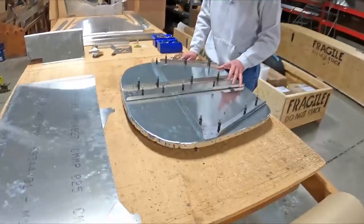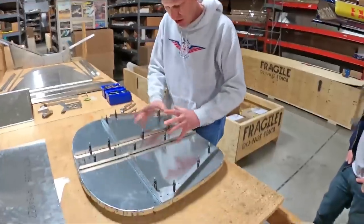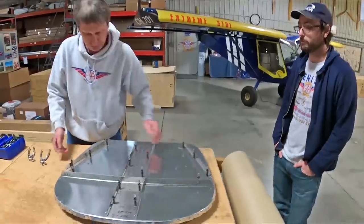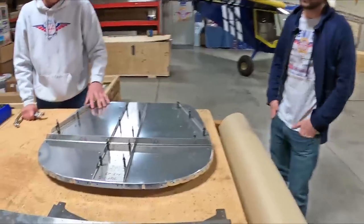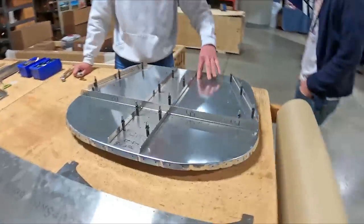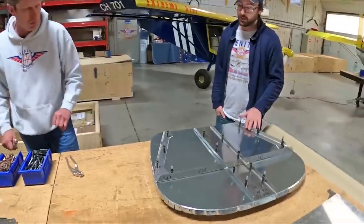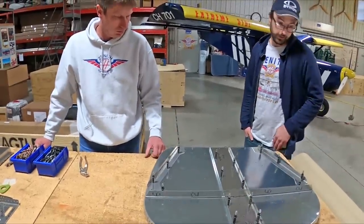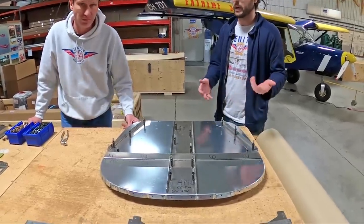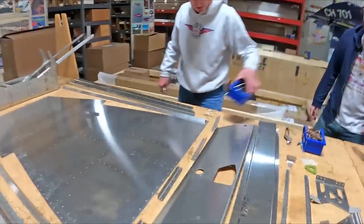You can tell on this firewall that it doesn't have the normal channel for the nose gear setup with the bungee or the new puck system — the tail dragger doesn't need all that reinforcement. The tricycle gear configuration will have the new puck system as standard with the more traditional build-up on the front. With the tail dragger you need a lot less structure up front, saving weight and giving a firewall specifically designed for that configuration rather than an awkward retrofit.